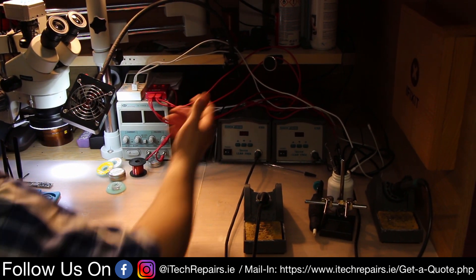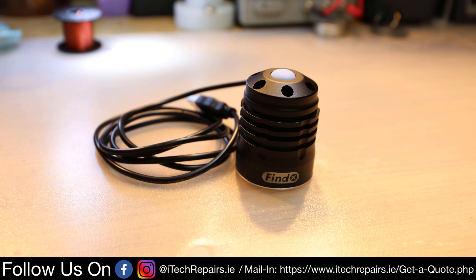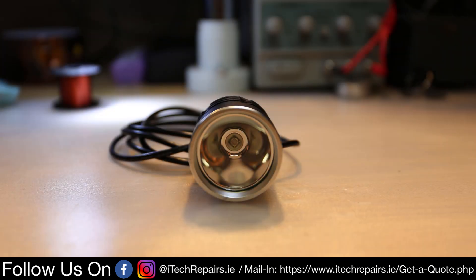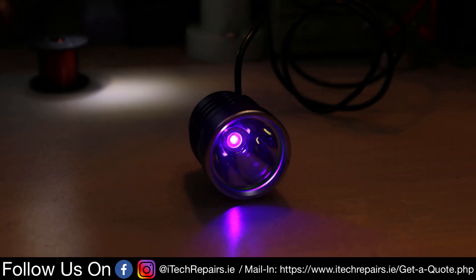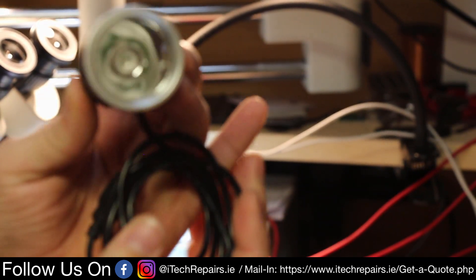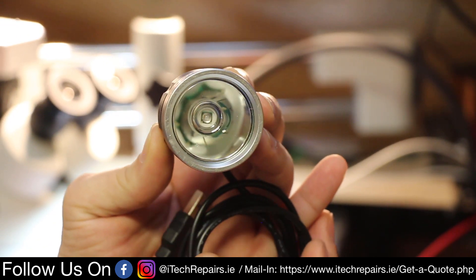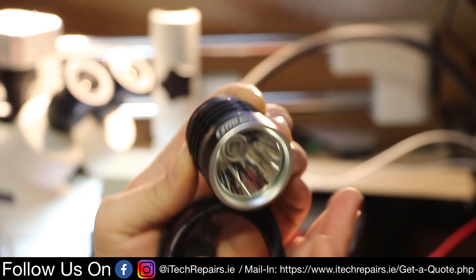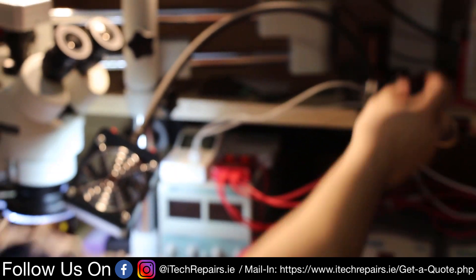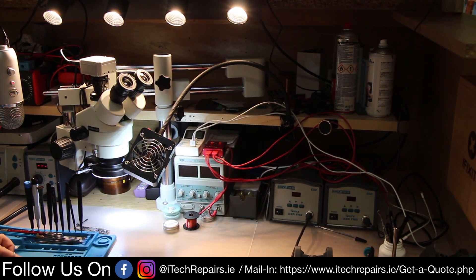The last item on the list is the UV lamp, which we got from Union Repair. In the past we used a professional nail UV lamp to cure UV solder mask, but this thing is an absolute beast — it has only one LED inside but cures everything probably 20 times quicker. We used to keep motherboards in the professional UV lamp for 15 to 30 minutes and the cure still wasn't perfect; with this lamp it cures in literally one to two minutes.